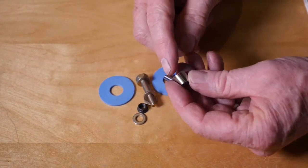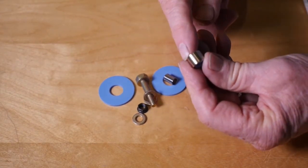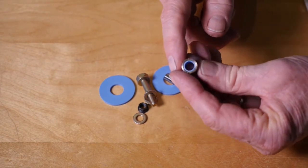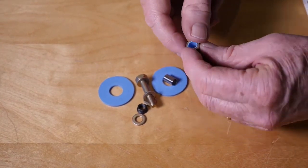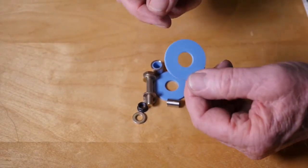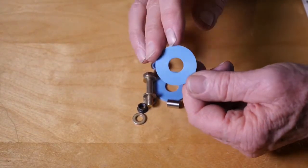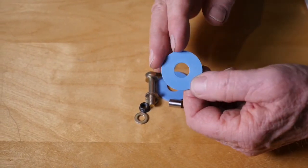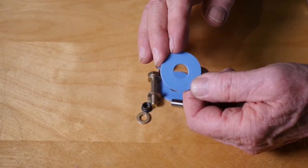The flap roller is also made from the same stainless steel and includes a free press-fit bushing made from Aerotuff grease-free material. The thrust washers are free-floating and sandwiched between the flap arms and the flap tracks. They slide against the tracks and because they're self-lubricating they do not require the track to be greased.